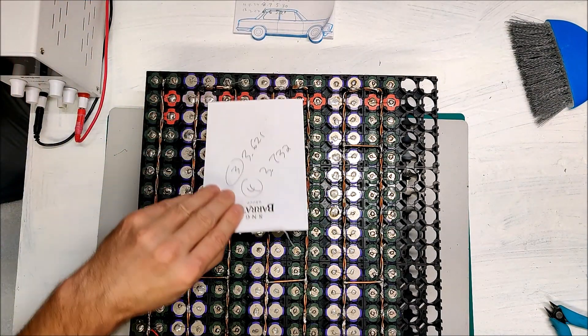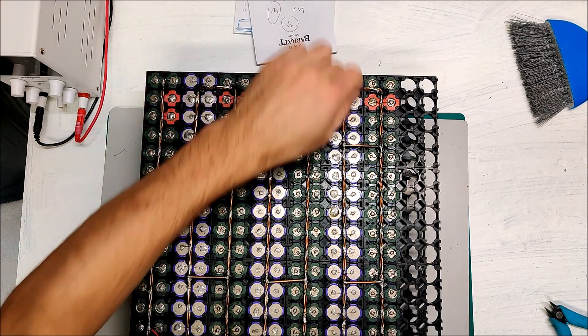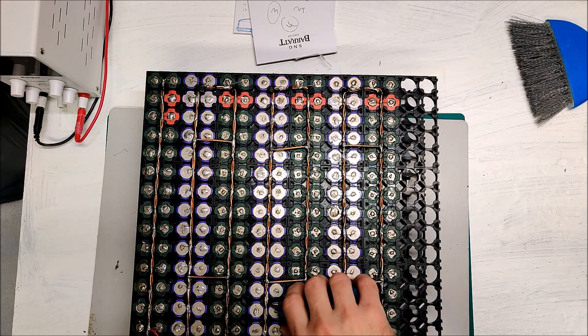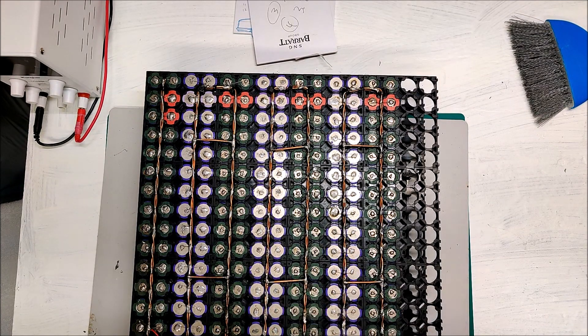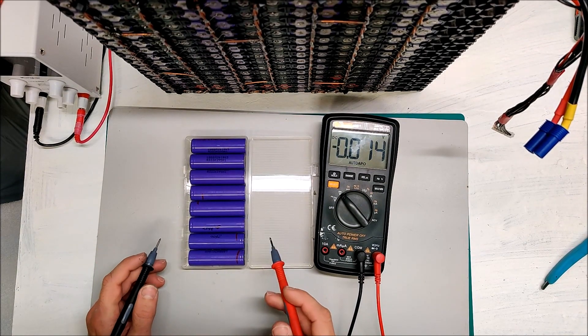Now we play a waiting game. I've jotted down the voltage each battery started at, and within a day or two we'll probably already find cells that are drifting — those are the ones we'll pop out. I just need to find a couple of these purple LGs in my storage box as replacements. Whichever ones are bad, you clip the plastic tabs in the cell holder and push the cell right out, slide in a new one, and reattach the fuses.